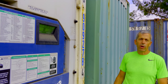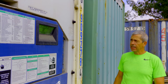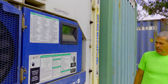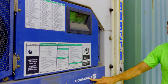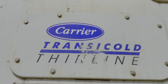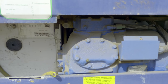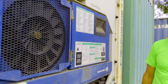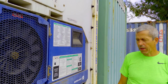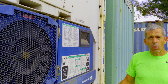The problem with the roll-up door is they're not very well insulated. You could put another set of insulated doors on it. This is what they call a MicroLink 2 — this is Carrier equipment, part of their thin line. Good equipment. The problem with this unit is the compressor — it needs a new compressor. New compressors typically run what they call remanufactured, or about $2,800 plus the labor to install them. After that, this would be a running unit again.